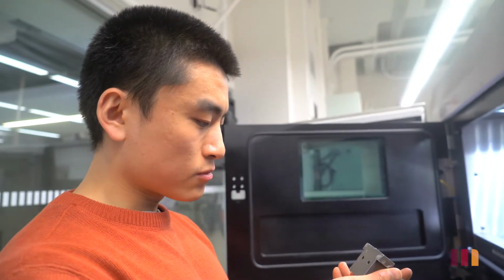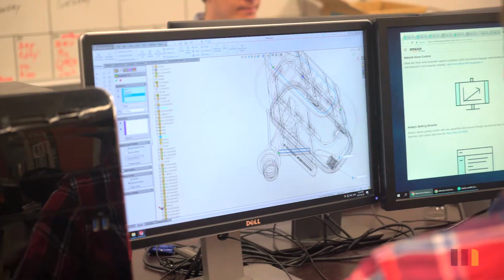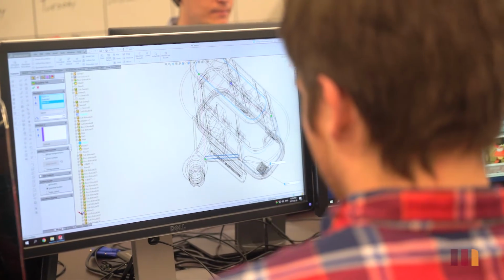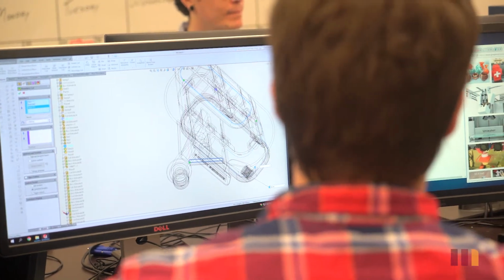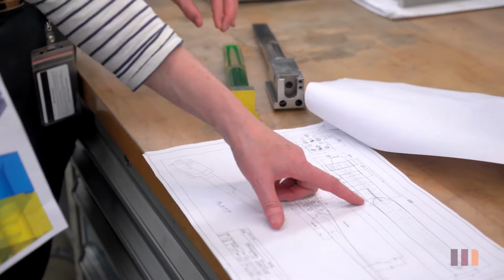process. In creating a conformal cooling die, such as the one that we made in this project, you begin by designing the part and designing the cooling channels of the die, and then using something called thermal modeling software to analyze how the temperature distribution of the part will change based on the new cooling channel design. In an iterative process, then you can work through if the cooling channels should be shaped differently or should be closer to the surface or further away from the surface of the part, etc. You can understand how best to model the design of the part.